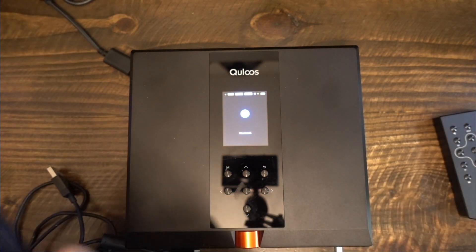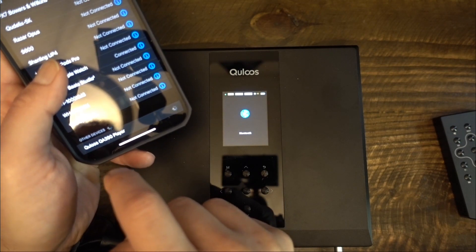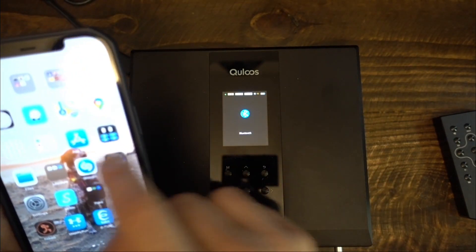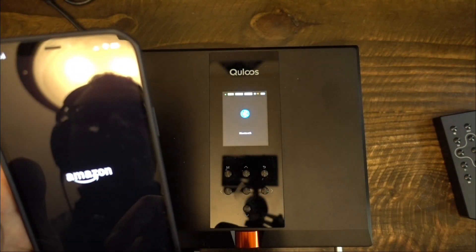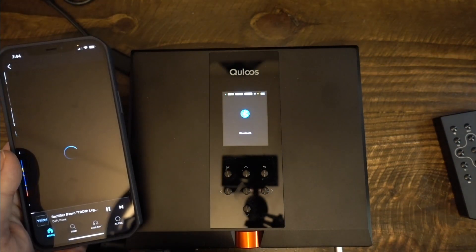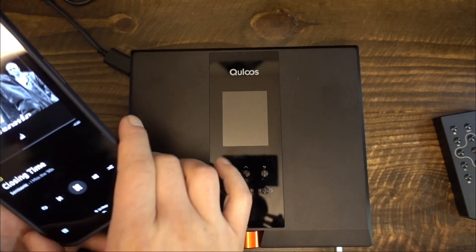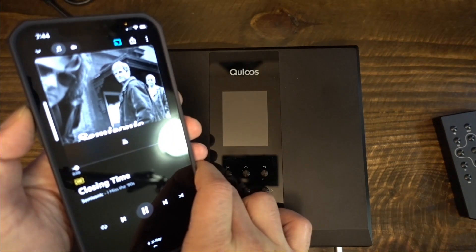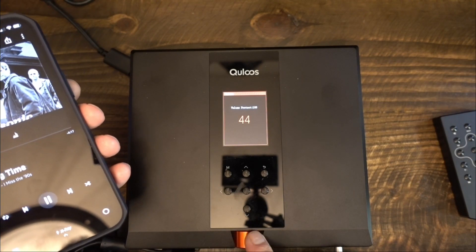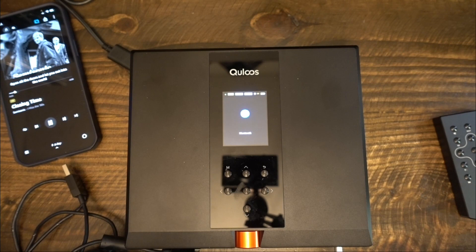The Argon is the same driver as the T50 and the T60RP. Mod House recommends at least 1 watt at 50 ohms. Connected to single-ended on the 390, the Argon became comfortably loud at step 45, but I think the bass was loose — not as impactful as when the headphone is paired with more powerful amps like the Magni and the 789. Moreover, treble seemed to be reduced along with clarity. The T1 connected via 4.4mm balanced became comfortably loud at step 36 and was at my personal pain threshold at step 50. At step 30 — the setting QLS used for battery testing — the T1 is certainly audible and within safe listening levels.